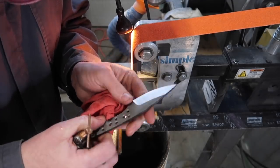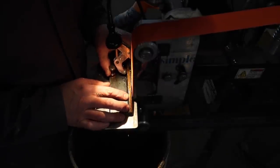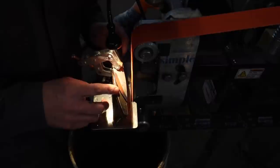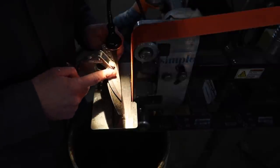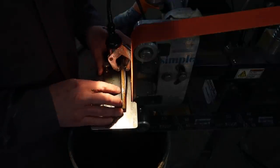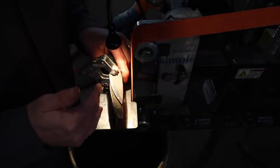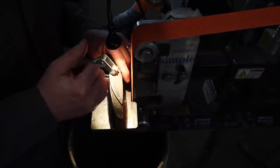There — that's a little bit more what I was looking for. One thing I find really helps with grinding is keeping it very consistent the whole way along. I always start here and work towards the tip. I like to take slower passes and do start to finish. As I'm growing the bevel I want to focus on keeping it consistent, fairly even. It's good practice for the finishing stages and it builds that muscle memory of working in a consistent manner.